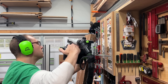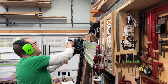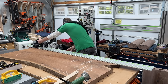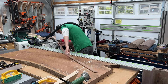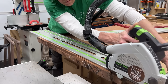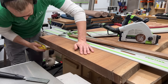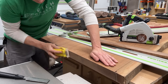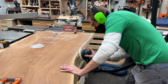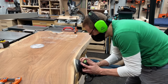And with the legs pretty much set, I could get to fine-tuning the slab. I needed to trim some edges and square some things off, so I'm going to do this with the track saw. I cut the one little chunk off on the other side of the crotch and then ran a straight line down the back. And with my straight line down the back, I could square off the other end perfectly to that. Unfortunately, the capacity of the TS-55 came up just a little bit short, so I had to finish that up by hand. Then it was time to clean up all the edges, get off any remaining bark. I'm doing this with 120 sandpaper and the soft pad on the random orbital sander.